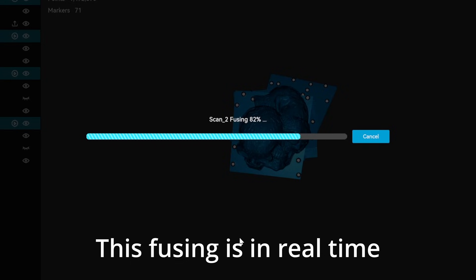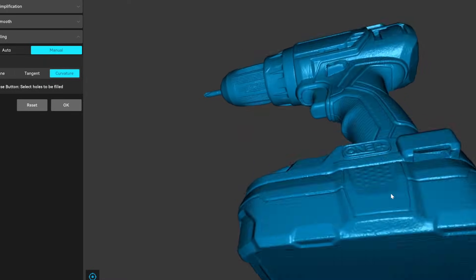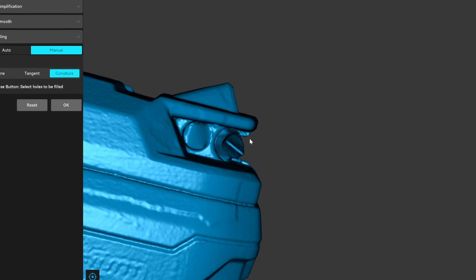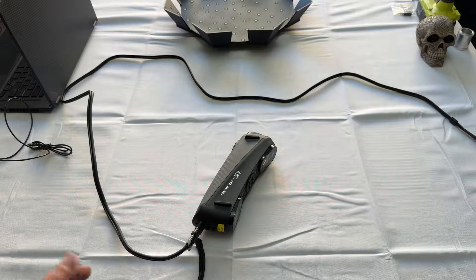The faster your computer is, the quicker the software will run. Fusing can take some time, so if you set the resolution very low like 0.1 or have a very large scan with millions of points, expect to wait a long time. I'd recommend starting at 0.2 and making adjustments as needed. As for the scan results, I think they all came out really good — from small to large to complex objects. A few parts could be smoother but overall I was happy with the results, and paired with the speed I can't really complain. If you're looking for a scanner for industrial purposes or reverse engineering and want the speed, I'd highly recommend this. It's more expensive than other scanners, but probably worth it depending on your situation. If you only need to scan small objects occasionally, check out the less expensive options like the Otter or Otter Light.